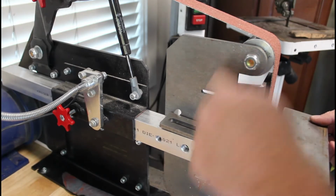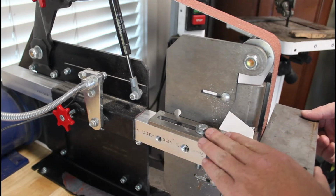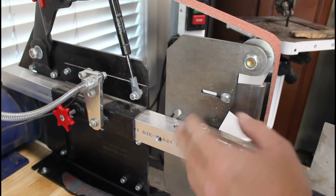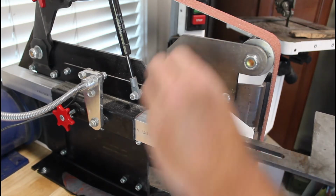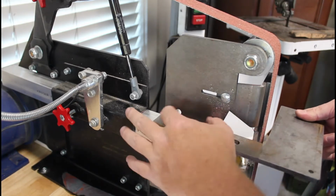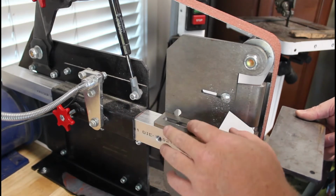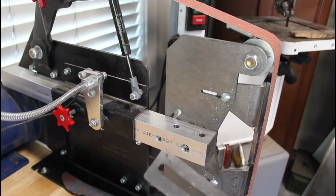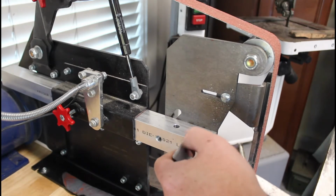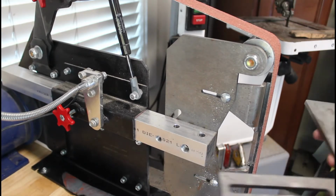Right now I get out the wrenches, but I can come up with a quicker way to do this, to where I can just quickly loosen it and swing it out of the way. In order to do so, I'm going to have to round this off inside there. It's not going to impact it. I've still got plenty of material here to keep things square. I'm just going to freehand guess it, get as close as I can without taking away too much material, and freehand grind some of that off and we'll see how this goes.